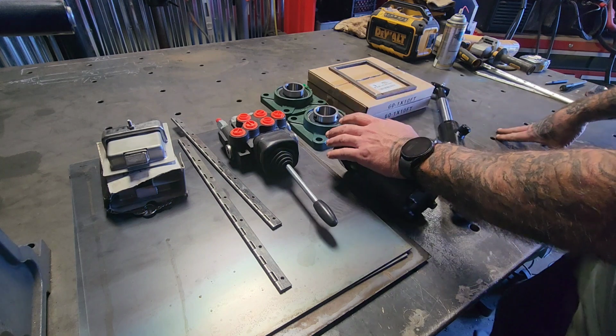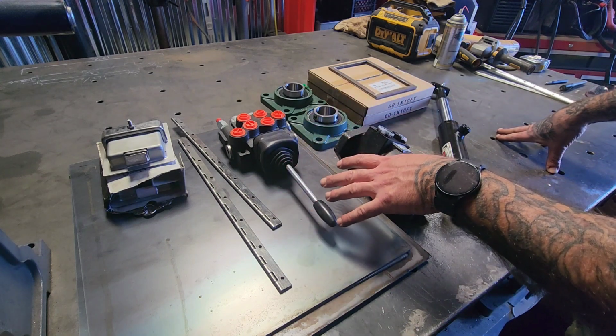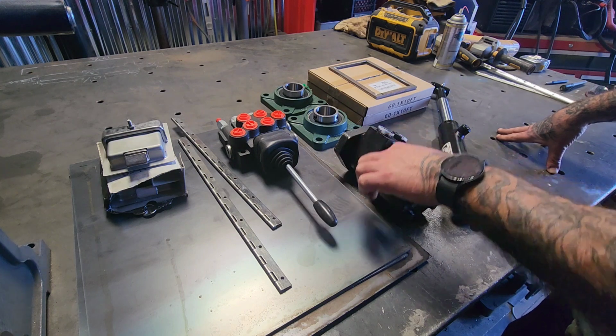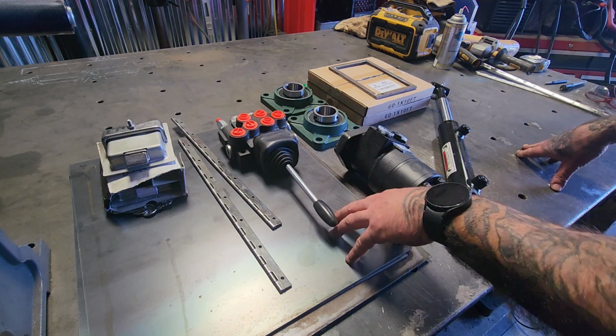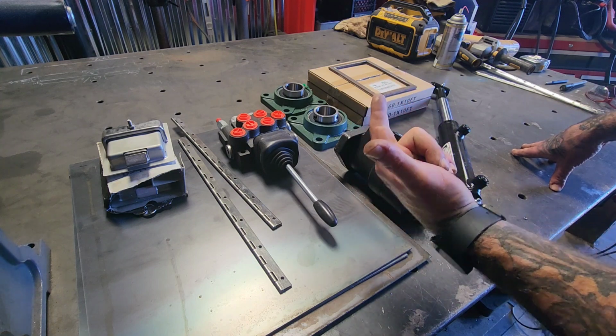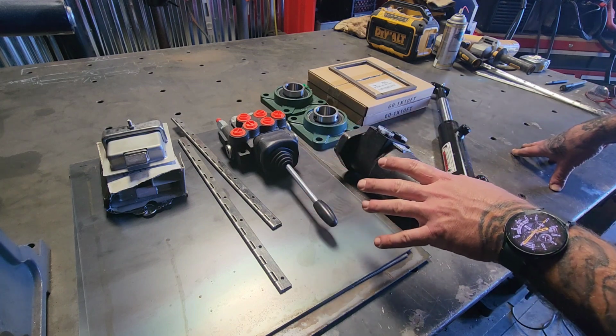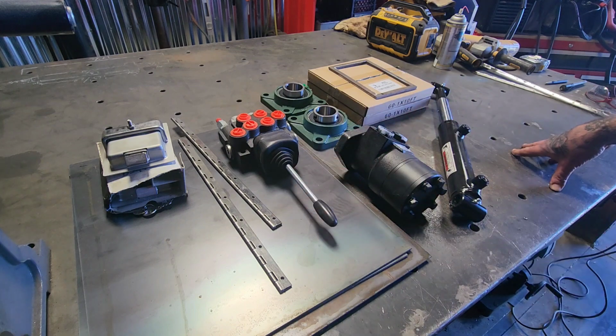I've got hydraulic lines to run, and what I'm going to do is have a quick disconnect set up on this, sticking out of the back, so that I can power this from either the back side of my tractor or my portable hydraulic power unit. So that way this will not have any kind of motor at all in it. It'll just be quick disconnect fittings.